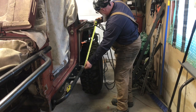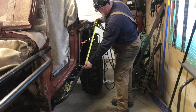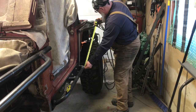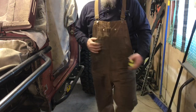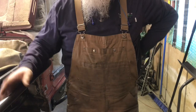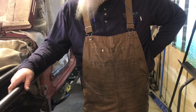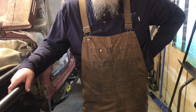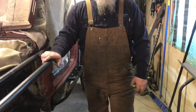And the furthest point on our notch up here is going to be about 26, so we're going to cut this tube to 27, and by the time I notch it all in, that should fit just fine. I'm going to take a minute and look at my scrap pile of tube from other cuts and ends of sticks to make sure I don't have something. I try not to waste any material.